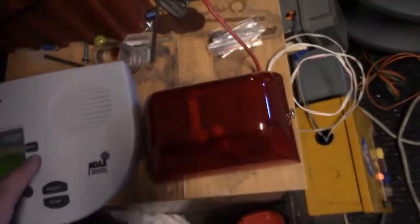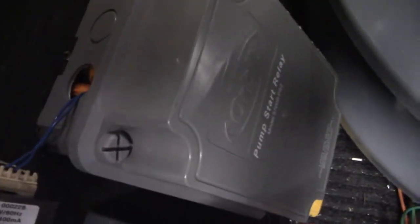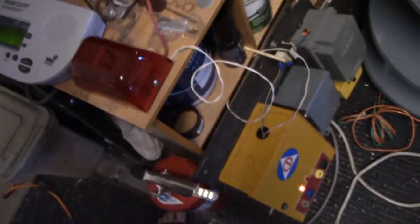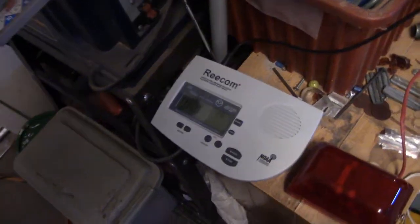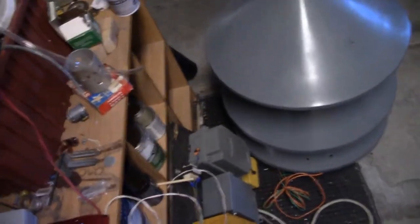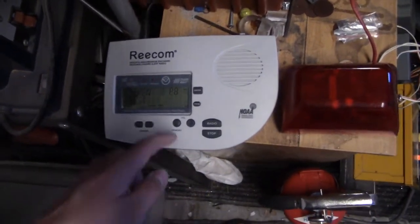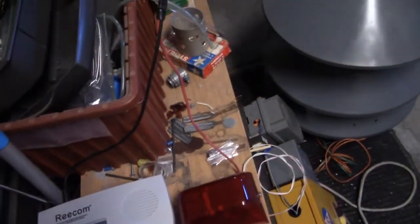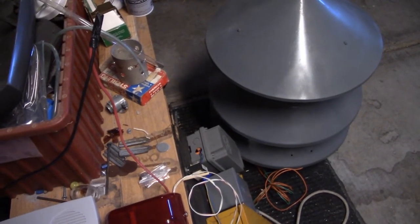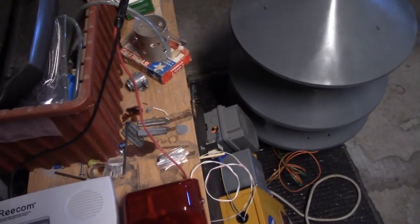Go back into program and give it a siren test. As you heard when I turned it off, you can hear the relay de-energize. I can bring the camera over here and do another siren test — that's the relay. You should be good to go. Now I'm going to connect up the siren and show you what it's going to do with the siren enabled. My siren is now turned on and connected. As long as the siren on the radio runs, the siren is going to keep going — that's why you want to set it on voice instead of alert. Press the button and let the siren wind up. As you can see it works really well.